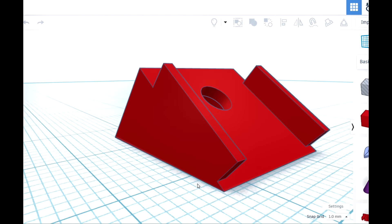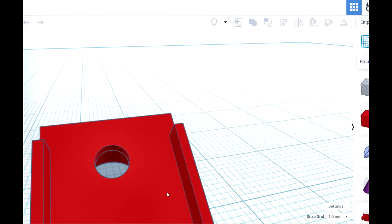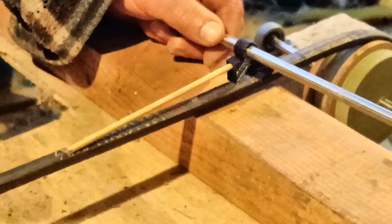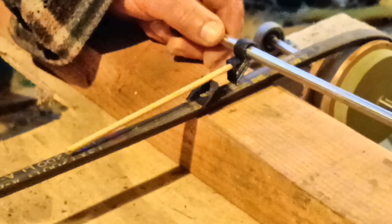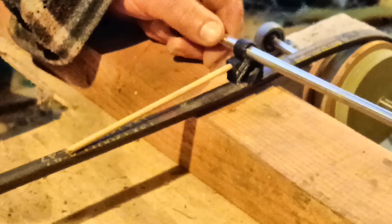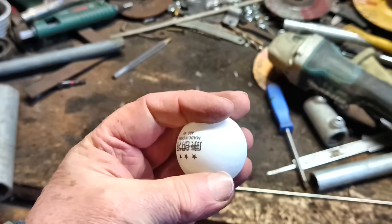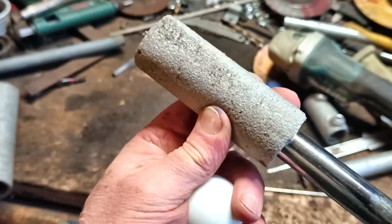The bumps can only be fixed in one place so the belt is still flexible enough to go around the pulleys, but I made little rails on the underside to stop them twisting sideways. I can decide how long the character stays up by the length of the bump, and I can have as many bumps as I like on the belt — and theoretically as many belts as I like. The arc made by the lever means the character wouldn't jump exactly vertically, but it's good enough. These characters have to be robust enough to withstand repeated bopping, as does the lever and the bump.